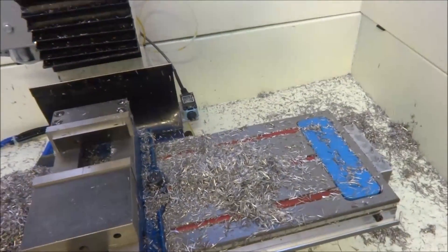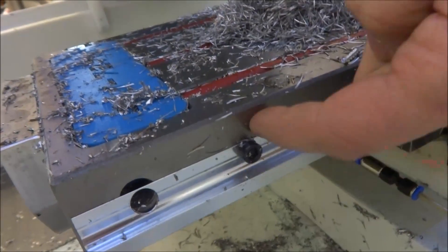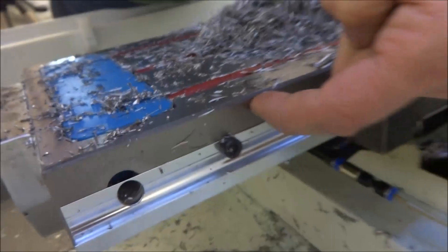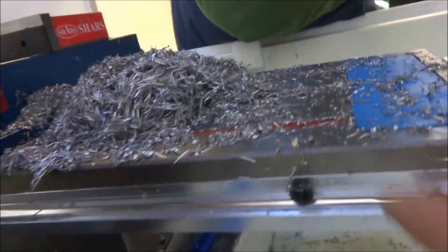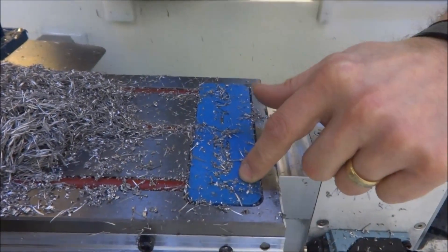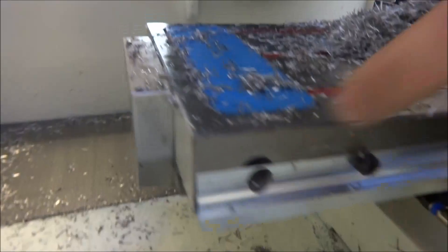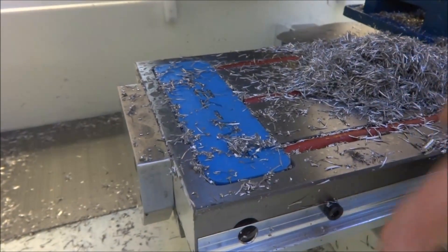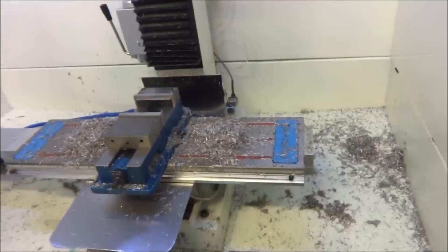On the back side, I wasn't as fortunate because the back side does not have a T-slot. So I had to drill and tap a couple of holes — not a big deal, because this casting drills fairly easily. I was able to just reach over and drill and tap it by moving the X table all the way forward. Now remember, I do have the two drain holes for these pockets here, so I made sure I drilled through for those. Any coolant that gets down into the pockets actually comes out the drain holes as well, and it's also tilted toward this side, so it keeps all the coolant flowing in this direction and running off the table.